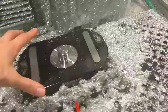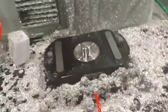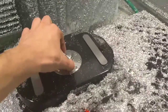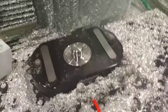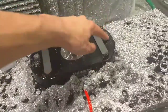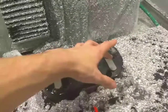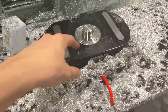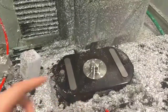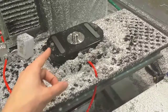Basically it holds down a big piece of aluminum, and you can mount your fixture in a sub piece of aluminum. Whenever you pull up on this little knob, it releases these detents, which are basically like a pull stud except inversed on a VMC. This pallet locates on these two pins, and you get your Z-repeatability along these hardened steel strips, because it's an aluminum base. Air pressure gets applied, and it gets its hold-down pressure when there's no air pressure to the base. So even if you completely lose power and compressed air, your piece stays solid.